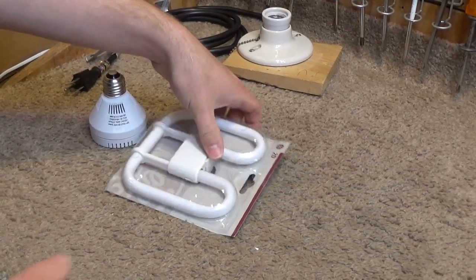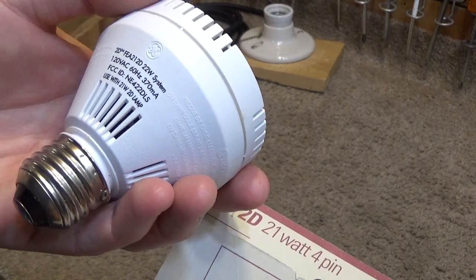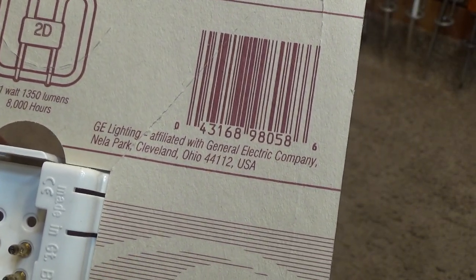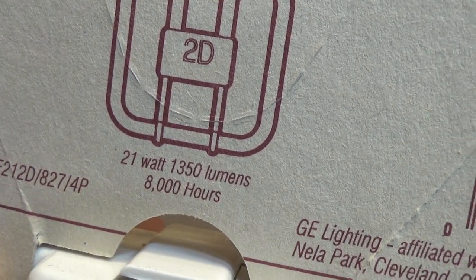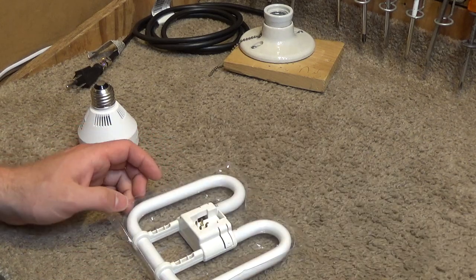This one is 21 watts and this is 22 watts — I think it's close enough. It does have mercury, which is fine because you can recycle it and it doesn't escape during normal operation. It's 2700K color temperature, 1350 lumens, and it claims to last about 8,000 hours. 1350 lumens would be the equivalent of about a 75 watt incandescent light bulb.